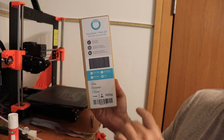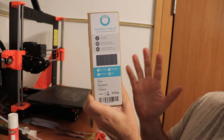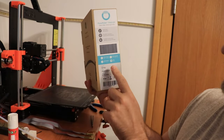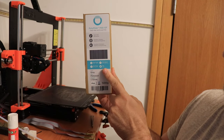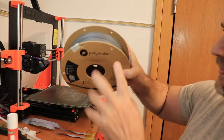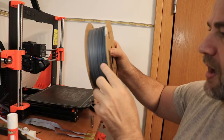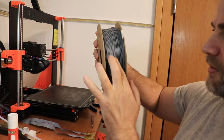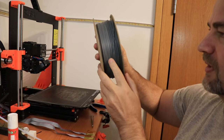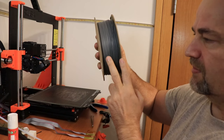I'm not going up to 300 because it is very close to the alarm temperature on this printer, which is 305 degrees Celsius — and I once had a problem with that. The bed temperature will be the same and the fan will be off. The spool is the same color, and it looks like it is grey. I thought everything was black. And like sandpaper I can feel those small fibers, so definitely pay attention that you need a harder nozzle for these materials.